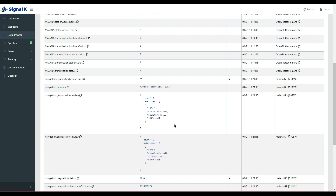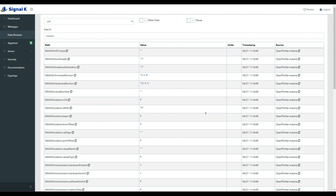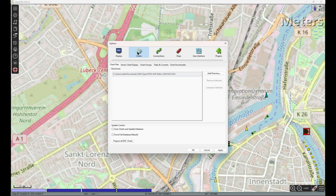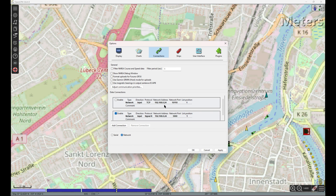I really enjoyed how quickly it connects — that was very nice. When you go to your plotter, you can see AIS information and GPS information for your ship immediately after connecting to your server. There are different connection possibilities: I connected via Signal K server on port 3000, but you can also connect on the TCP server on port 10110. Both work. Signal K is the preferred connection when using OpenCPN, but for other tablet apps you can simply use TCP, and you will get GNSS and AIS data directly via the server.